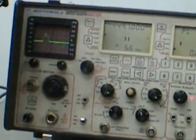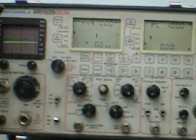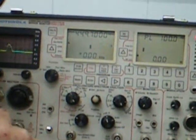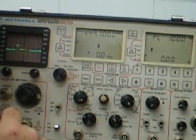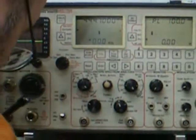I gotta zoom in on the scope when you did the beeps there — that was cool. Look at how much you can zoom in on this one. Not bad for a little camera. Good thing it was only about $100 for this. The 6R is testing. 449.7 — okay, but how close is that? That doesn't look dead on in the center of the band, eh? Look, it's making waves all over the place. Pretty good, eh? That's the spectrum analyzer.